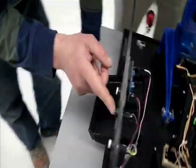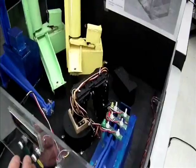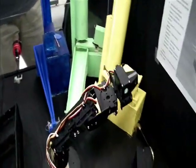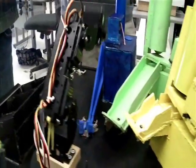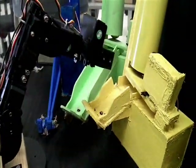The second option is a work envelope option. I select that and it is going to show you how far the robot arm can reach and what it is capable of. The third option will show you a dry cycle — the robot arm goes and does what it is supposed to do, showing every position and motion during the process. It will keep doing this until you cancel the operation.